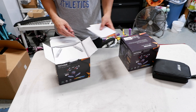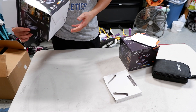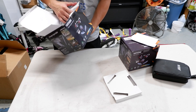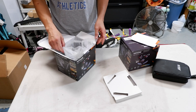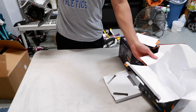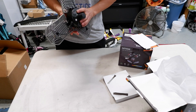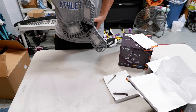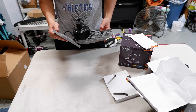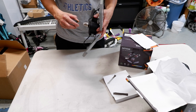I think they're only about 30 something dollars on Amazon — I'll post a link if you guys are interested. They sent me the 80-watt version, rated at 8,000 lumens. So that's 100 lumens per watt, which coming out of a screw-in LED is a pretty decent efficacy. These days in the industrial applications I'm designing, we're putting in 170 to 175 lumens per watt for actual fixtures and luminaires. Commercially available, there are fixtures over 200 lumens per watt. So this is about half the efficacy of an industrial-grade, very expensive LED fixture — well over $250 for the fixture.